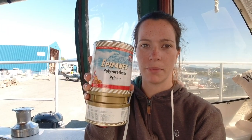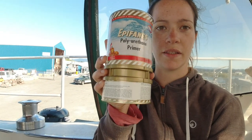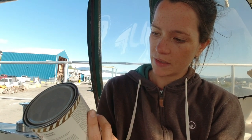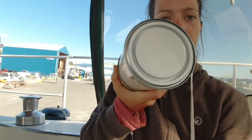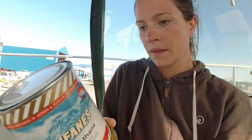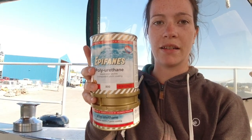So I was starting to make this video and I realized I didn't actually tell you guys about our product. For painting all the flat spots on the deck, we decided to go with Epiphanes, which is a two-part polyurethane paint. The gray stuff you see in the video is the primer — a two-part semi-gloss polyurethane undercoat — and the stuff on top is a nice white glossy finish. It comes in two pieces, and there's enough space in the can to mix the small one into the top can, which is what they recommend.